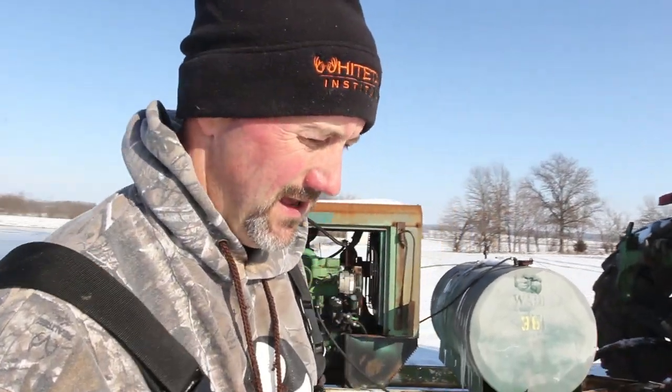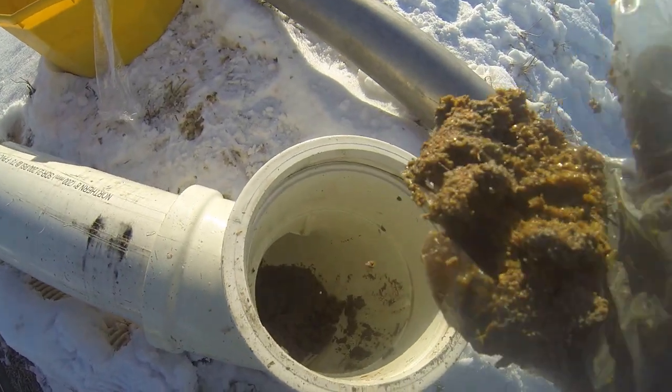Well, I think I finally got it. There was a bunch of salt feed. There was actually chunks of manure bubbled up on top of the water. So whatever was holding it back disappeared, and in turn, let that manure come down. And there was some salt in the pipe, and then that brown foamy stuff that was on top of the ice was typically what it looks like when the acid dissolves the salt. So I think we've got it. Now we're just gonna get out of these waders, go get a different pickup. We'll get the lagoon pump primed, and then it'll take about an hour for the flush tanks to fill. We'll get showered in the hog barns and flush it and see how it's gonna work.